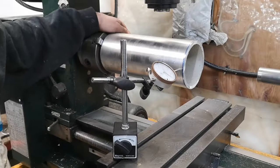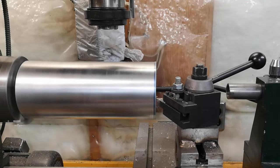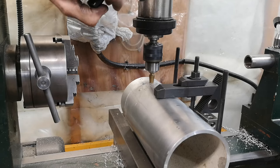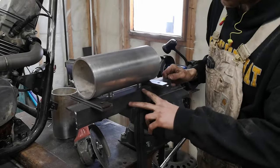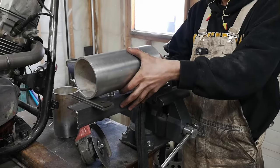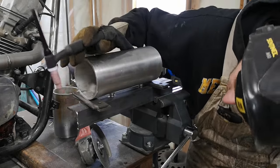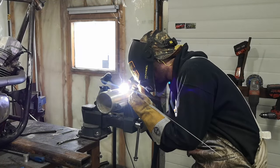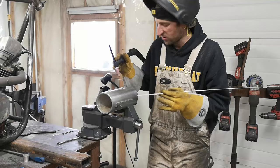This thing's not exactly round, but I got it within 10 to 15 thou, which will be square enough for the end. I drilled out those holes and then I have those bungs mounted to the same piece of angle iron that I mounted the brackets on the frame to. I cleaned it out on the inside and I'll just give it a tack. Oh yeah — way better. I forgot that I knew what I was doing.